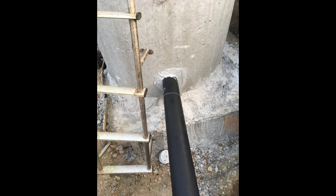We then used a 4-inch core bit to drill out the other side of the supply tank and fitted the 4-inch supply pipe. This proved to be a more accurate fit and the pipe had just to be tapped and wedged into place, which made it easier to seal. A polyurethane-based sealer was more than adequate.